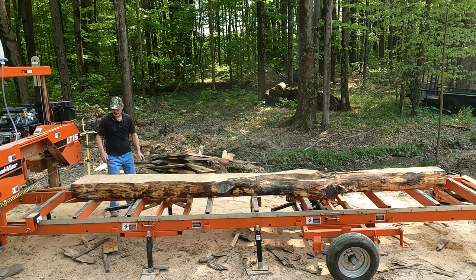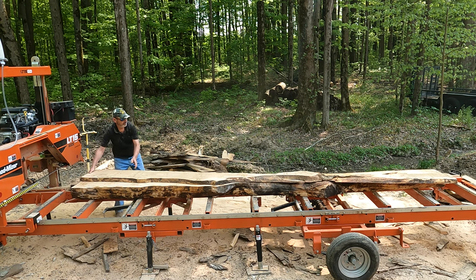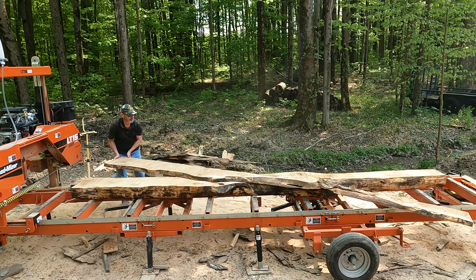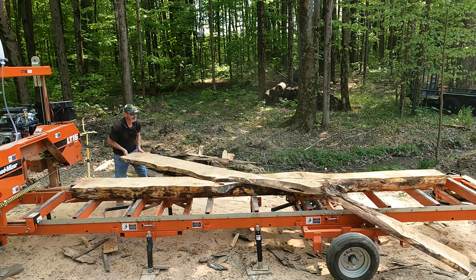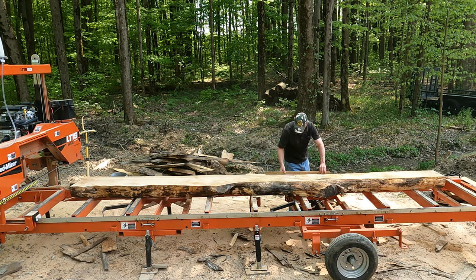Yeah, I don't know if that's gonna work either. We ran out of log in the middle there. You can see it's breaking. Oh, and it's punky. There's a hole. Well, that's gonna get cut off maybe. Yeah, that'll get cut off.